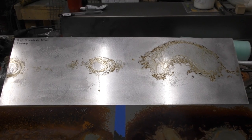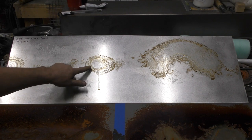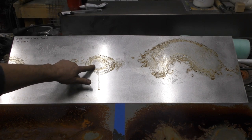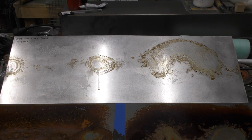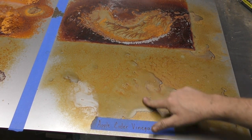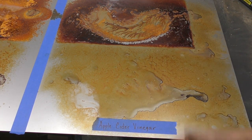On a side note, the stainless steel actually took on some rust and discoloration. Keep in mind, this is a typical 304 stainless steel, so it does have the ability to corrode — it just typically takes a long time. But you can't really wipe it away easily, so it's starting to get into the metal. If you're looking to corrode or rust stainless steel, vinegar might do the job, it's just going to take a lot longer. Once you've given this a clear coat, you can try to wipe it off and it won't come off — the clear coat protects that surface rust.